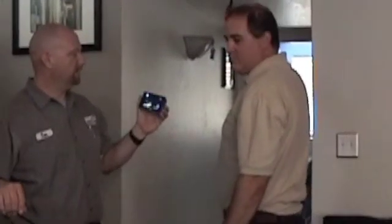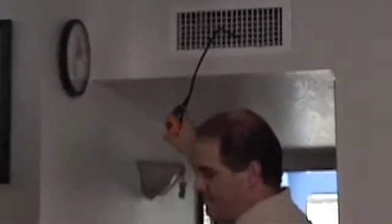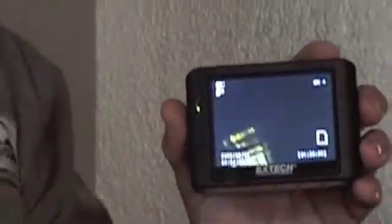What we're doing here right now is we've got the bore scope that I showed you earlier with the detachable screen — you can see it's removable from there. Jim is a gentleman helping me right here — he can move the camera around. Basically we can use this for wall chases, behind stoves, to check out coils. What we're using it for right now is we're looking inside the ductwork to see if there are any places that need to be sealed. And as you look here, we can tell that definitely a duct cleaning is in order. And as we look back inside the ductwork here, we can actually see the seams that have never been sealed inside the ductwork. There's a potential leak right there at the seams inside — that's what this bore scope is good for.